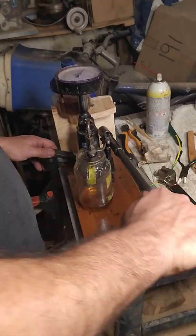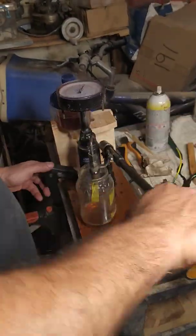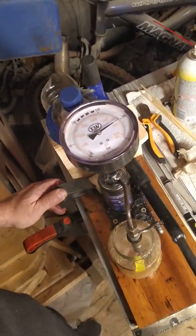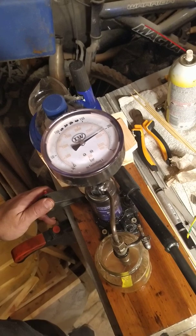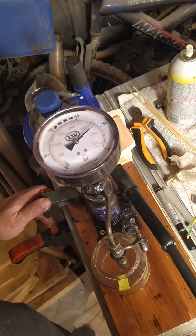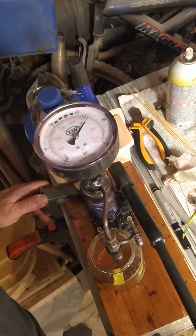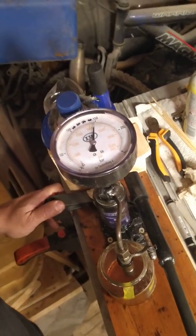How you do it? Increase the pressure near the opening, and then rapidly pumping, and as you can see, the needle stops in between 191 to 200 bar, and then it releases the pressure like this. Okay, you need to watch it carefully. It is almost exactly 200 bar, which is like the other 3 injectors, so this should be okay.